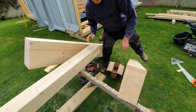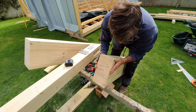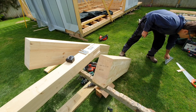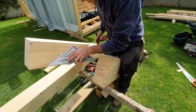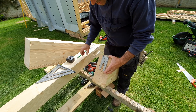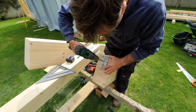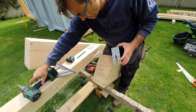That section is done now. Let's get the section on the end fitted - I don't like that end, it's not very clean. We'll get a center line marked on here. The idea is that this section is flush with the top of the beam and that sets everything correctly. I'm going to sight the center line, pilot the two central ones - super crucial.